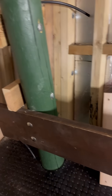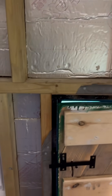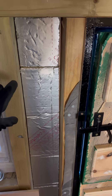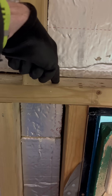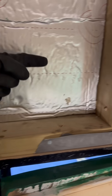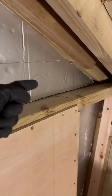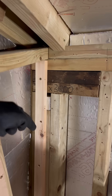The problem I'm working on today is we need to find out where the switch wires will go for the lighting switches. There's going to be a switch here and then the wire needs to come up and go through this, so I need to put a hole in that and the wire will come along. This is basically how you would route it inside a house. It comes through there, and I originally wanted to come down and then into the fuse board this way, but there is a large piece of bracing here so I can't get through.